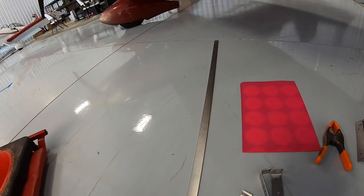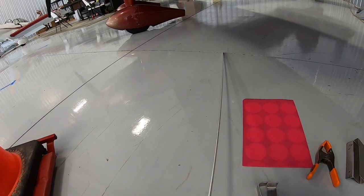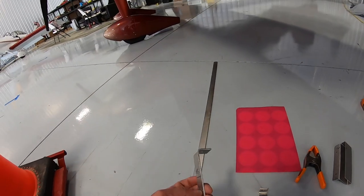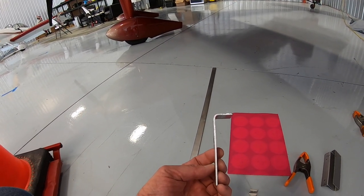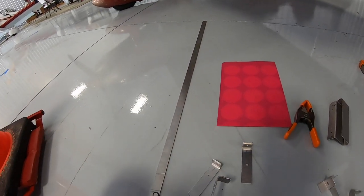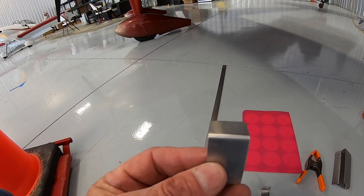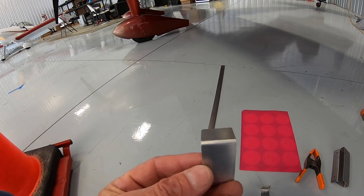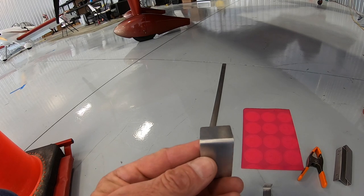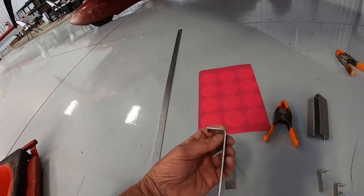To build the brackets, I had a bunch of these little strips of aluminum cut up — they're one inch wide and 3/32nds thick. The only thing I'll say about making the brackets: it'd be nice if you have a brake, but I just used a vise and a couple blocks of wood. You want to put a nice radius on it. If you bend it too sharp, you can see it stretches the metal on the outside of your bend — you can actually feel where it's tearing apart. So don't bend it so tight that you weaken the metal.